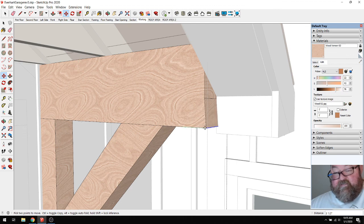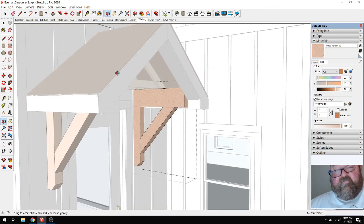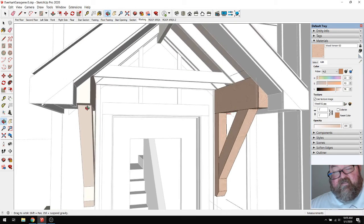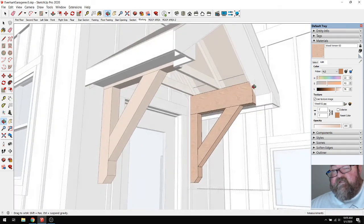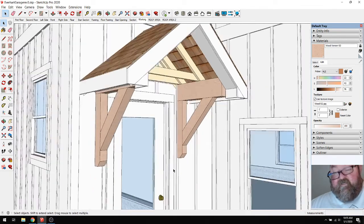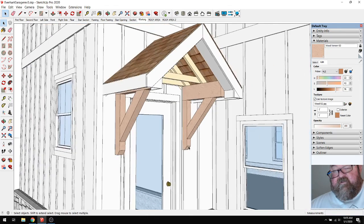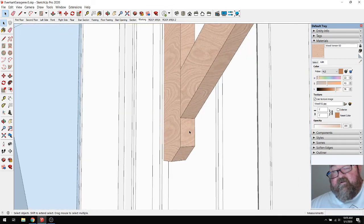I'm going to lock my axis to there and then delete. And both of those should have been fixed since I made that a component. Yeah, see, that's why I'm making a component. It fixes both of them. So it may be that we just make that one squared off, but leave this chamfer on this one down here. And then this would be where I run my lag bolt in, right there in the center